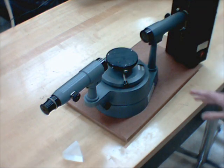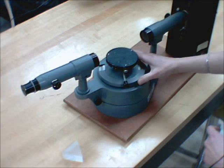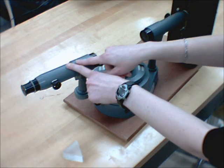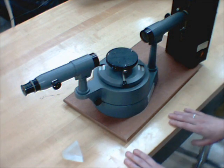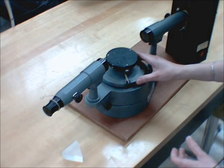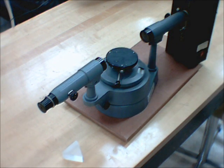The rule when taking data is that if you're moving the telescope, you want the table locked, and vice versa. Either the telescope is locked or the table is locked at all times. The reason is that these things aren't quite as independent as we'd like — when you move the telescope a little bit, that tends to move the table also, and vice versa. So these two things can screw up your data-taking.